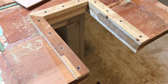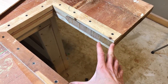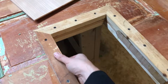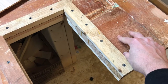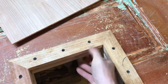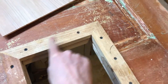I took the clamps off and went ahead and put these screws in but didn't film it. The reason I want this to be so secure is because I've cut the bottom rail of the door right in half and removed the middle piece, so there's a lot less structure there. I need this to be a kind of frame holding it all in place, which means the connection between the frame and the door has to be really solid, and the frame has to be able to take some moment at the corners.